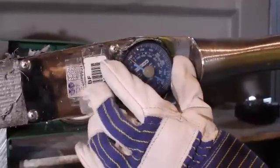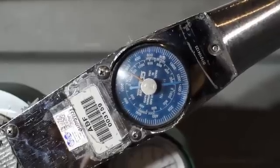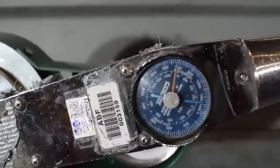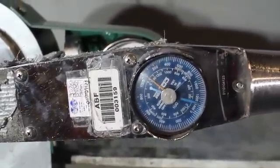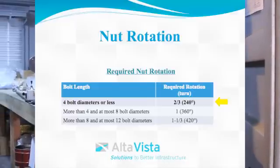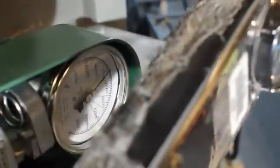Before using the torque wrench, make sure that your dial is set to zero. After this step, verify the torque required to turn the nut further. The torque value should not exceed the tension in pounds times the diameter of the bolt in inches divided by 48, or 711 ft-lb for our fastener. Now, since our fastener is less than four diameters long, the nut must be turned an additional two-thirds of rotation. Use the Skidmore faceplate and torque wrench socket markings for reference. Here, we measure 600 ft-lb.